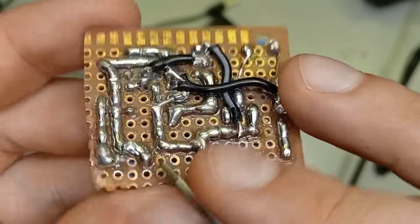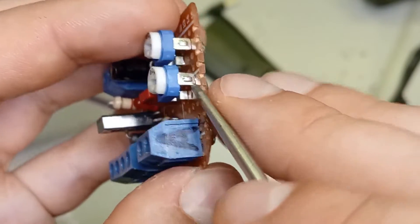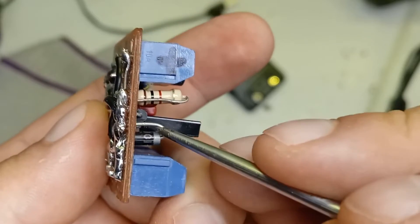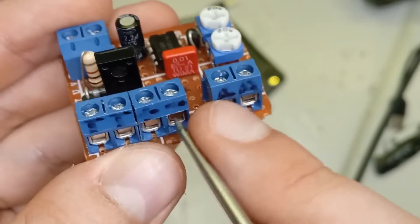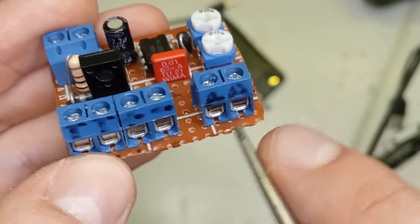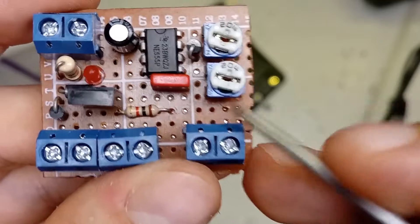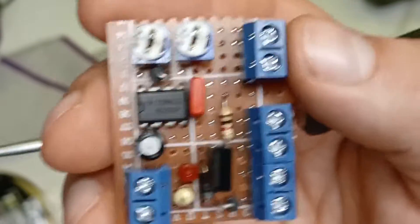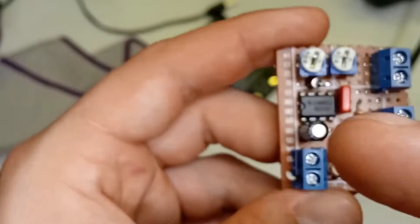For the full auto: one side of the terminal block goes to pin 7 via the selector switch, and the other side goes to one of the pins on the potentiometer — I've chosen the wiper pin because it lines up nicely — and then one of the other pins of that potentiometer goes to pin 6 of the 555. Also make sure your reverse polarity protection diode has the anode going to positive and the cathode towards the positive side of the circuit. If you want to put a fuse on this, a 1-amp automotive blade fuse should be enough. So: negative of the battery goes here, positive there, trigger contacts go there, selector micro switch contacts go there, positive of the solenoid goes here, and negative of the solenoid goes here. Adjust your dwell time with this one and your full auto time with this one. And that is how I made my HPA FCU. If you found this useful please leave a like, leave questions in the comments, and subscribe to the channel.